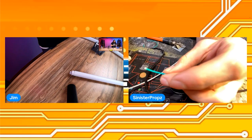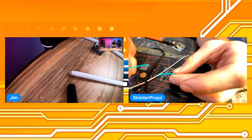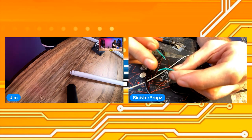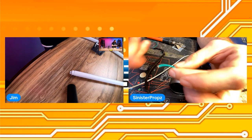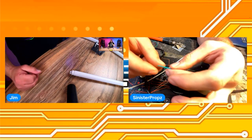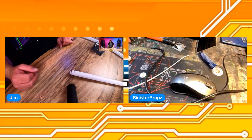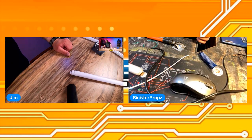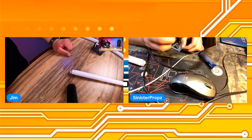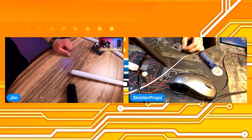You're going to take small clippings of wire. A pair of each. You're going to clip one end. So the red, the positive, the negative, and the data line. You're going to trim one end of each, and you're going to tin it. So time out. I need 3 clippings of wire. Well, you need 6. Red, black, and green. And you're only going to need a little bit of wire.